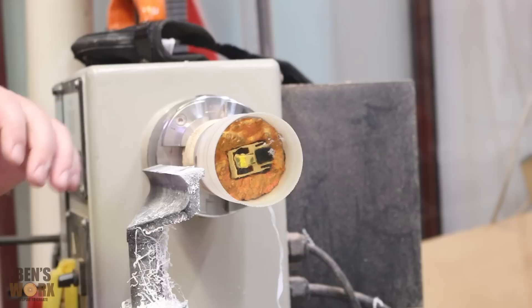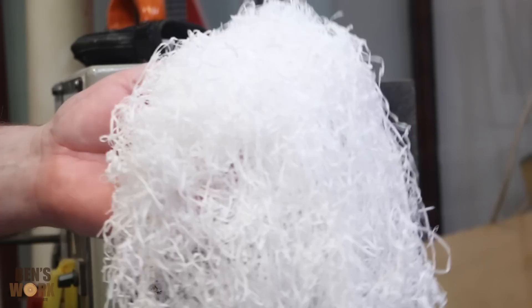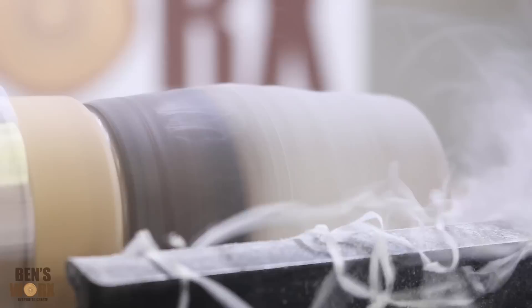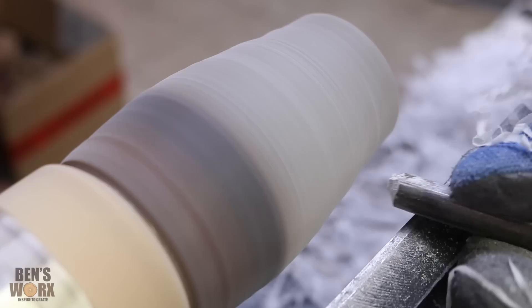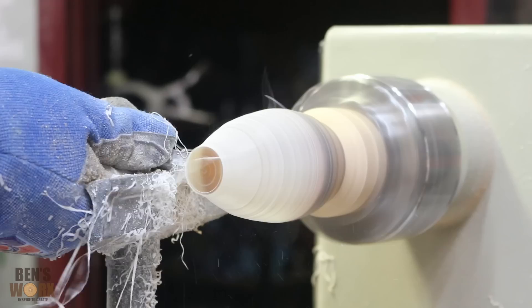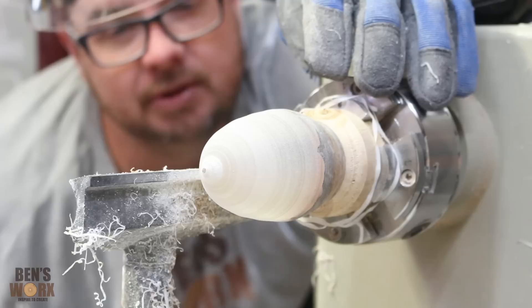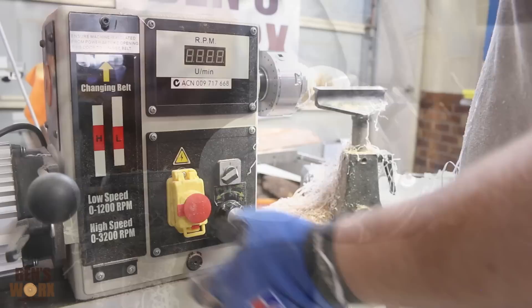Normally when I make my dragon eggs I use a silicone mold like this — that way it reduces the amount of waste I have. But when I cast an object inside I want to have a bigger blank so I've got more room to move and I don't nick the item inside. The unfortunate part about that is I do create a lot of waste. Now I've got my rough shape sorted out, the next thing I'm going to do is take my skew chisel, get all the tooling marks out and fine-tune the shape a little. For this I'll turn the speed up to about 1200 RPM and then we'll get a nice finish.